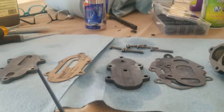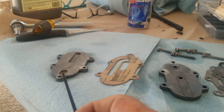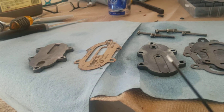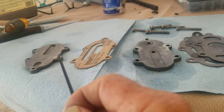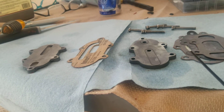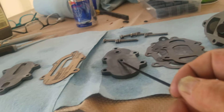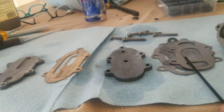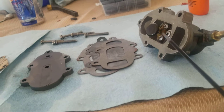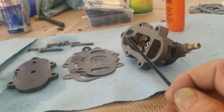The rest of it is your air pressure — it comes from a cylinder. You've got two ports over here on your base, so you've got alternating suction and pressure coming up into this air manifold. Everything's got to be separated by gaskets because you don't want any air or fuel escaping, and you don't want fuel and air mixed together. It comes up against the diaphragm, and on the pressure side it'll push that diaphragm up into this bladder, compress the fuel, and push it out the discharge side to your carburetor.